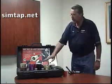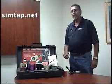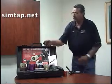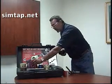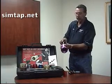The SimTap Drilling Machine comes complete with one body and 10 adapters to accommodate all the valve manufacturers in the waterworks industry. Simply take the body, which is constructed of T6 billet aluminum. It also has a left-handed thread. Take the appropriate adapter for the corporation valve that you're going to be drilling through, and screw the two together.